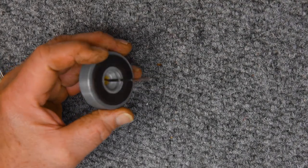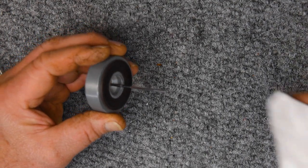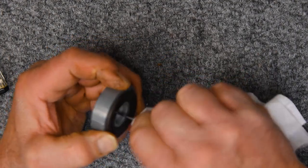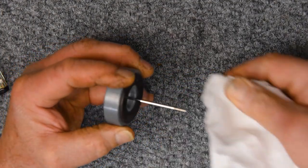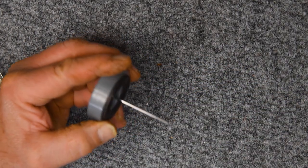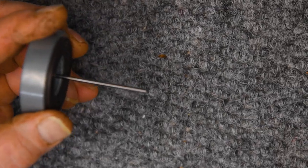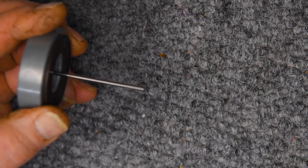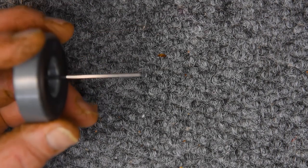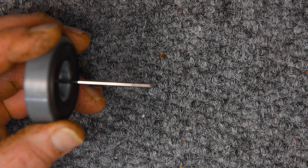This capstan has been bead blasted and there's a moderate amount of wear on that. And when I clean it up and take a look at it, I decide to go ahead and resurface that. I have the ability to bead blast here. Yeah, I'm sorry that didn't focus too well. I think I'm actually too close for it to focus on that. But yeah, we'll just take care of that and make that like new.